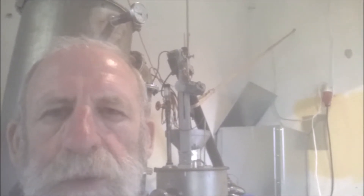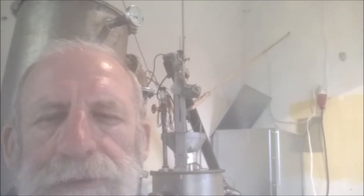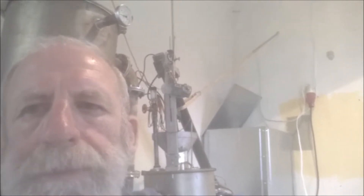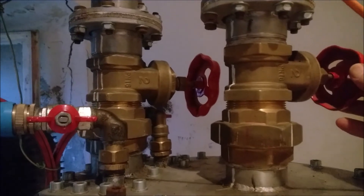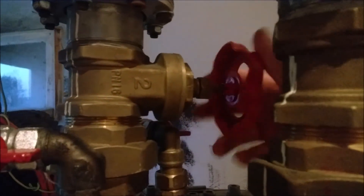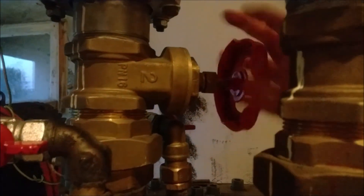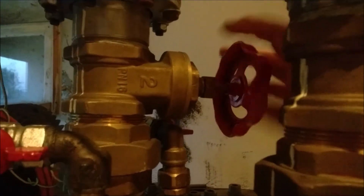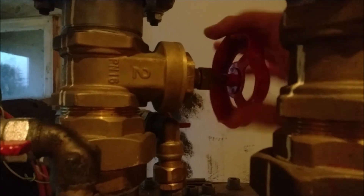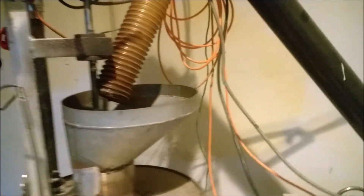I will do a series of five-hour runs, and the filter will suffer the most from the beginning, because when the gasifier is cold it produces the most dirt. So let's start it all up. I have my filter and unfiltered lines — I'll close the filter and open the unfiltered to start the duration test unfiltered first, so the cold gas which is always a little bit dirty goes through, and when the generator is up to temperature then we switch over.